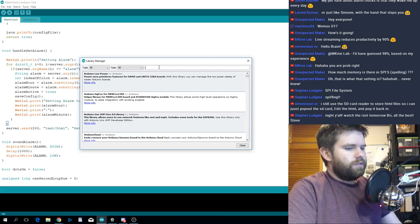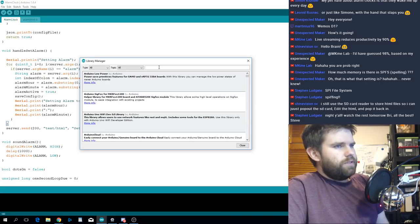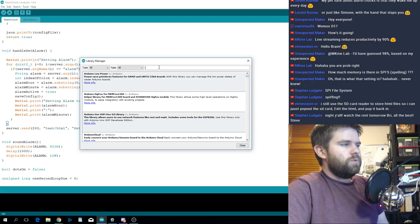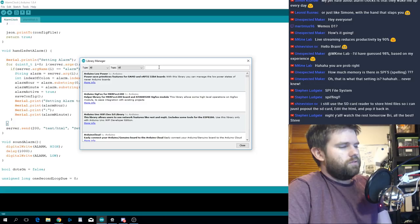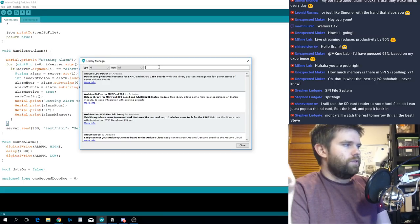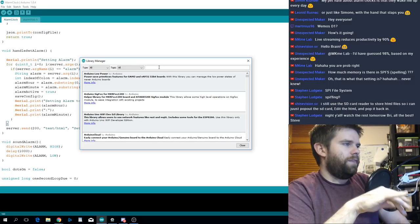So it was just a simple one that went to the distance matrix API. So the Google Maps endpoint has a couple of different endpoints, and the distance matrix was one of them. And I did that, and that would give you the travel time and would take into account traffic. But what it didn't let you do is specify points on the route. So it was fine for, hey, I want to see how long it takes me to get from Galway to Dublin. But if you wanted to say, hey, I want to go from Galway to Dublin via Cork, you couldn't do that. And it would take the best way between two points at that given time.